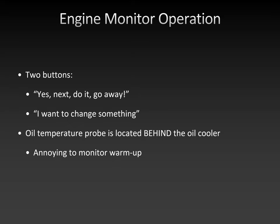we're there. And what happened there is that the thermostat valve allowed the oil to go into the oil cooler now, and it flushed, it now actually put the oil cooler into the oil system, where previously it had bypassed it. And only then, when you actually have oil going through there, it hits the new probe. And that's why you see this little bit of strange behavior on startup.